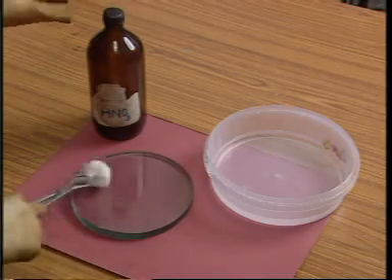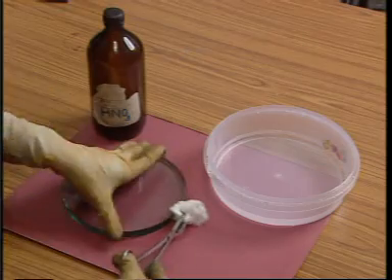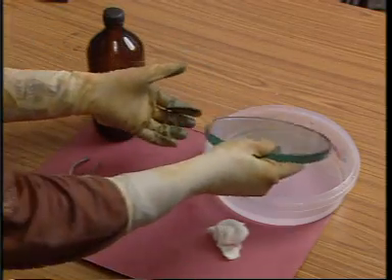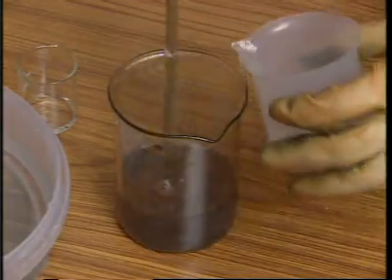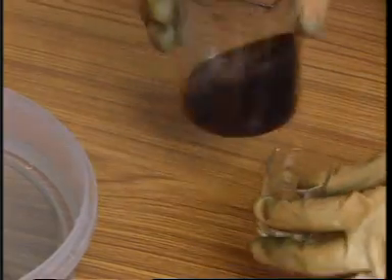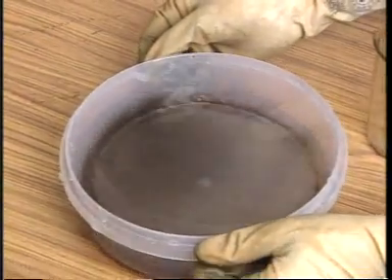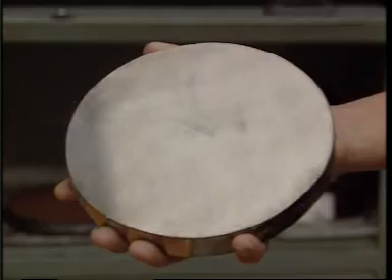After fine grinding and the Ronchi test, the interesting process of silvering is done. The mirror is now ready to be coated with a highly reflecting material. After cleaning the mirror with fuming nitric acid, rinse it in water and make sure it is always covered with water. In this process, metallic silver is precipitated from a solution of a silver salt, usually silver nitrate. You can also deposit silver in any chemistry lab or at home, as Vinaya is doing now.